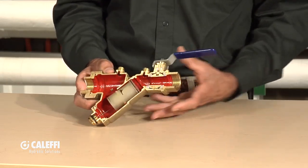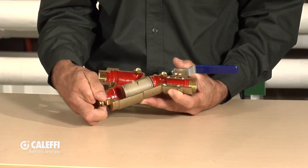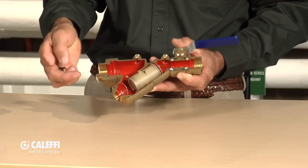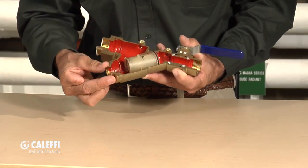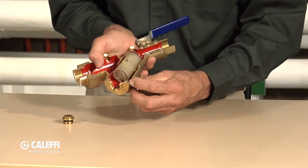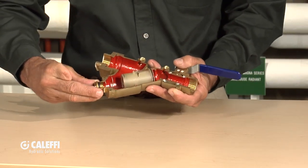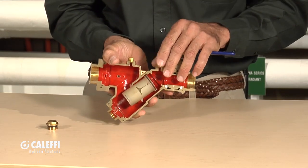It's in a nice brass housing. There's a port at the bottom that you can flush and clean out — take that cap out, and with the isolation valve we provide, you can shut it off and back-flush any debris that might settle in the bottom. There's also a larger thread so you can take it apart and remove the cartridge. Everything is machined with a fine thread and O-ring, so if you have to service it, it's easy to unscrew and get back together leak-free.